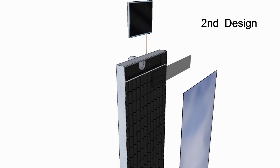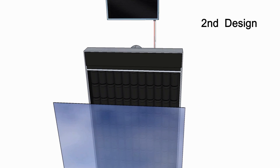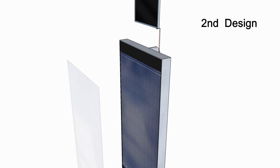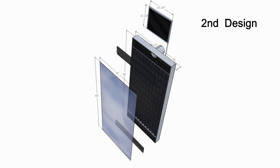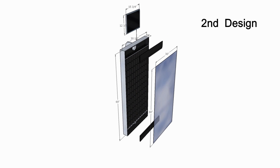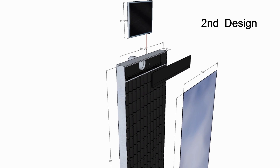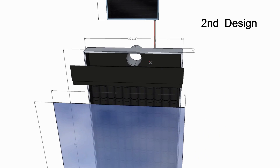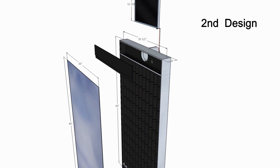Essentially all I had to do was switch from 10 columns of 13 cans, or 130 cans, to 11 columns of 12 cans, or 132 cans. The plexiglass will completely cover the heat chamber, but will no longer cover the 5-inch intake and exhaust manifold areas at the bottom and top of the unit. That's fine — I'll seal that portion with either a piece of half-inch treated plywood, depicted here, or a separate small piece of glass.